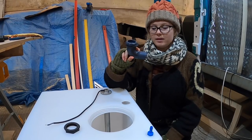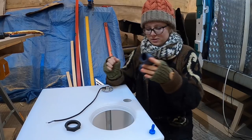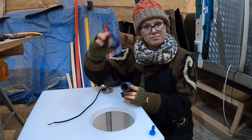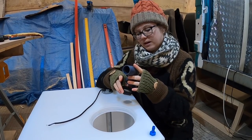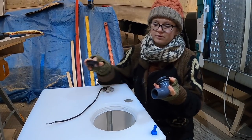This is the water filler pipe. We're going to stick it on the outside - it has a washer and a little nut that goes on the inside to squeeze together so that it's watertight. You don't want to over-tighten these things because once you do that they stop being waterproof, so careful does it. It's very cold, and we didn't do anything yesterday because Sophie had a migraine.